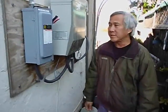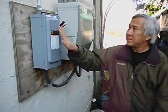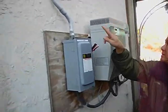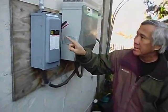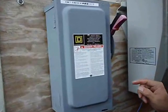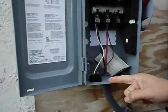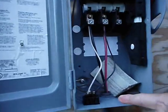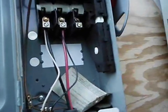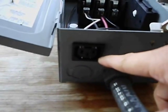I'm going to try running some devices off of high voltage DC. This is my solar system — it goes up to the panels and it's getting about 200-210 volts in the DC disconnect. I've actually wired a separate socket down here into the DC disconnect so it's in parallel with the solar inverter, and down here there's a special jack that I have.